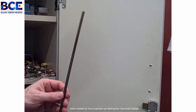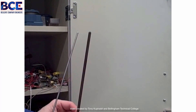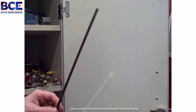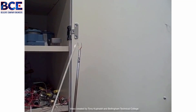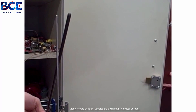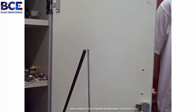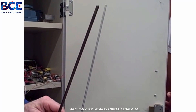The question was asked: can we tell if this is grounded or ungrounded? You cannot tell that visually — you can only tell that with a meter. The difference between a grounded and ungrounded thermocouple is internal and you cannot see it without cutting it open. However, we know that in both these cases they are not an exposed tip. An exposed tip would be obvious — you would see the thermocouple wires jut out with a little blob at the end where they're welded together. You don't see that here. These are both covered tips, sheathed by stainless steel.